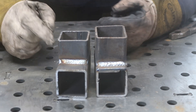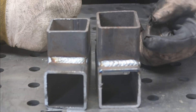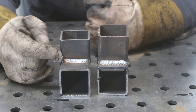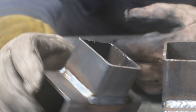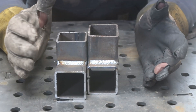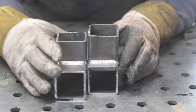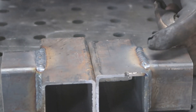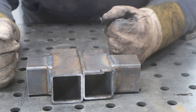We got these things completely welded up now. Over here we have our 75/25 or C25, and over here we have our straight CO2. There's not a whole lot of difference — I can definitely tell that our C25 burns in just a little bit hotter. The profile on that weld, if you look at it down the side, it's a little bit flatter, while the CO2 has a little more of a crown. We're running the exact same settings on both. Even on the sides, the 75/25 was just a little bit flatter. Let's cut these things apart.